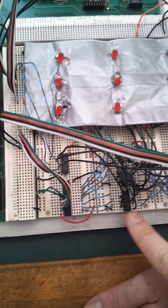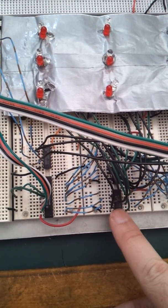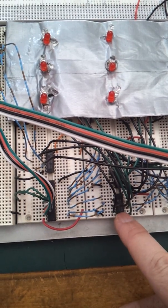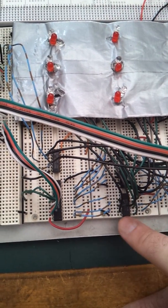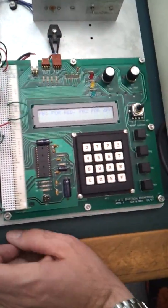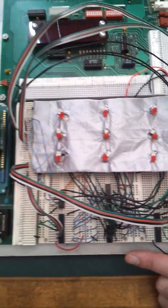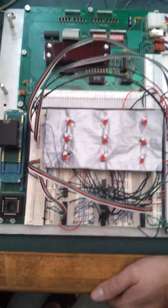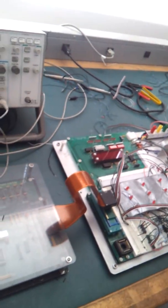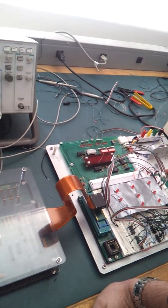We also had to invert each one because outputting would initially output at high for everything, so we had to invert everything so that we had the correct logic. For each push button, we also had to use pull-up resistors plus also invert them so that it would work correctly. Everything else seemed to fall in place pretty easily.